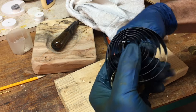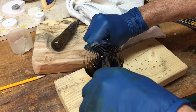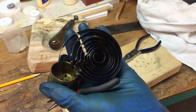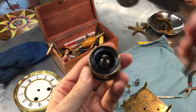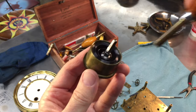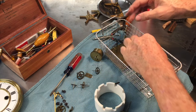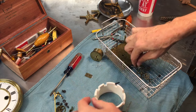I got the kink out of it and I just need to get it bent so that the hook can pick it up. I've got a couple pairs of needle nose pliers and I'm putting a little bend on this thing. I've got it reshaped and I think that'll work. Off camera I'll see if I can get this back in, and it looks to me like it's going to wind. I'm just amazed how well that worked out. These springs are so clean — all I'm going to do is lubricate them. I'm not even going to go into the time side since there doesn't seem to be anything wrong there. I'm ready to move the gears and plates into the ultrasonic parts washer and let them run for half an hour, maybe an hour, for a first good cleaning, then come back and hand clean everything in detail.